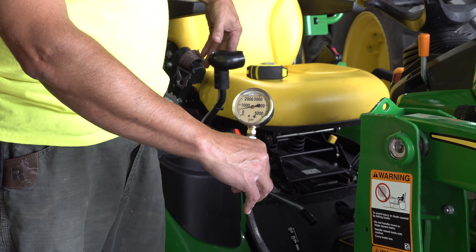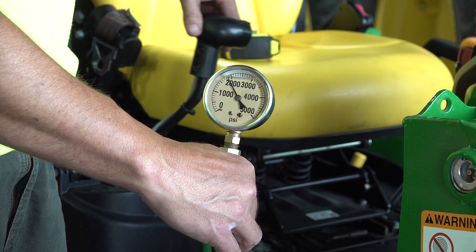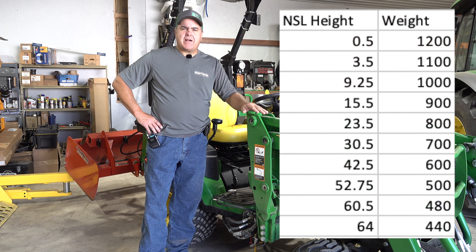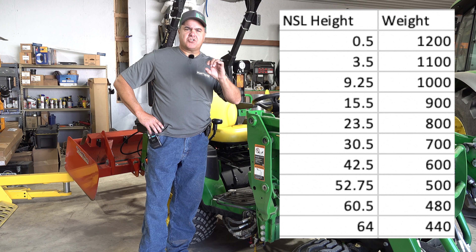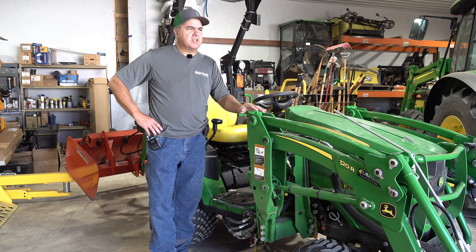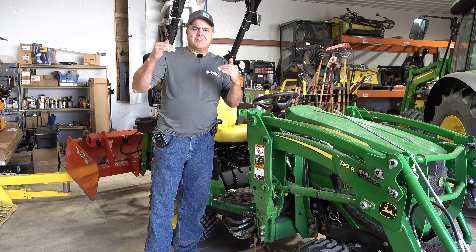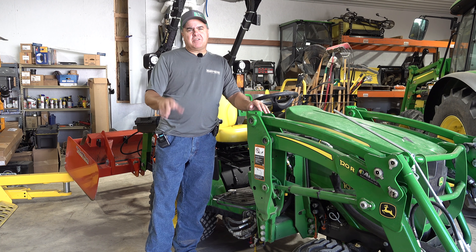You can see here that the pressure would get up to the 2000 PSI range, but it would kind of fall back. Watching it closely on the video, we were seeing it fall back maybe even to 1800, a little lower. This impacted the overall capacities that we saw. We'll include those capacities in the final graph to show what it did at the 1800 PSI range. All of those numbers ended up under the spec capacities for the loader. At first we thought we could just indicate that the absolute numbers might be off, but the range is going to be the same — they're all just going to be a little bit higher. As we thought about it more, we said no, we have to do this test again.